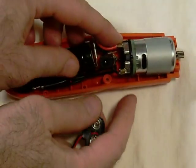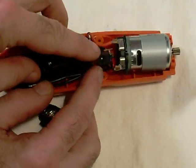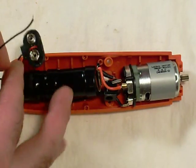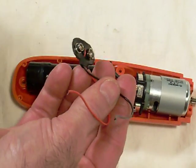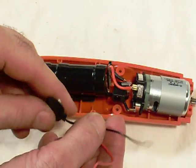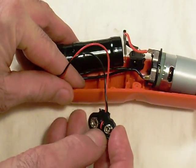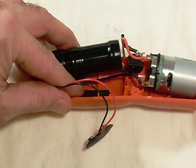The switching on this is such that you can't turn the cordless on when it's plugged into the battery charger, and there's a forward and reverse switch. So I'm going to bypass the switching — it's just too much to deal with. I'll basically just attach a 9-volt battery clip — you can buy a five-pack for a buck or two — and attach the leads to the front and back of the battery, then run the wires externally. This will be my external connection to power small electronics or charge battery packs.